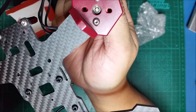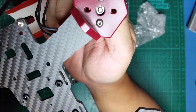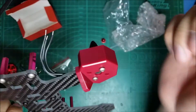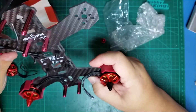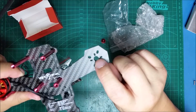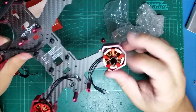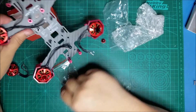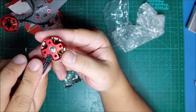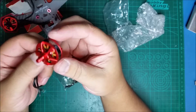The spacing on this frame is for 2204 motors and it fits, but if you look really closely the ring is rubbing against it — it's a very very tight fit. What I recommend is you shave the hole down just a little bit so that it clears, otherwise there's a little bit of drag. I'm not too thrilled with the c-clip style on these motors; I'd rather have a flat washer c-clip or a lock nut.